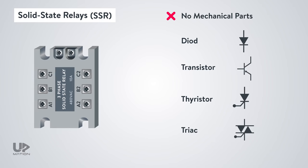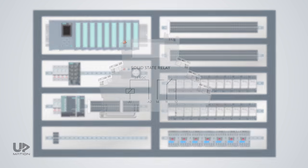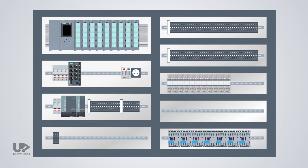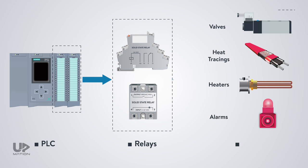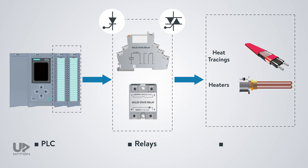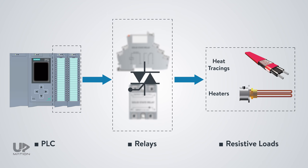There are different designs for different usages. For example, when you're designing the internal layout of an electrical control panel, you're always in need of more space. And this relay, as it has a slim design, would be an appropriate choice for you. You can use it as an interface between your PLC output cards and the loads out there in the process. However, as you'll see in future videos, the thyristors and triacs are more intended to drive the resistive heating elements, and therefore the solid-state relays which use these electronic parts in their output circuits are also more applicable for these purposes.